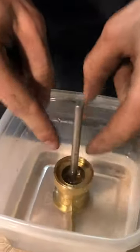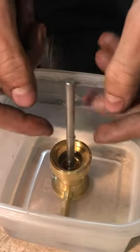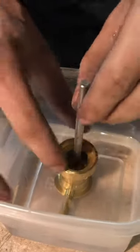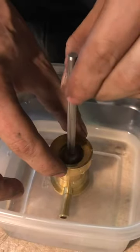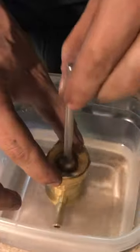This is going to have a dome over it with a discharge pipe, and the dome's going to have a little — not a packing gland, but a follower here, so it's sort of like a crosshead guide for the piston rod. But I don't have to put very much effort into this at all to get it to lift water.